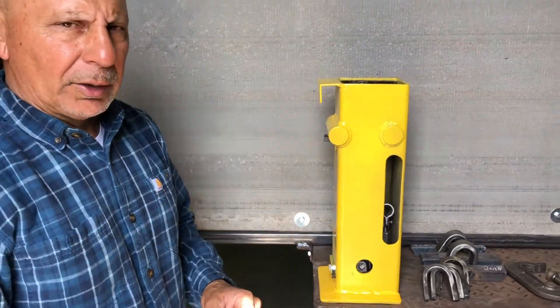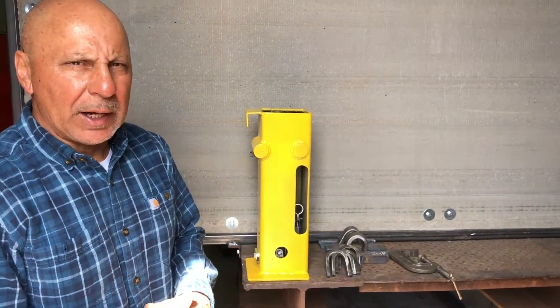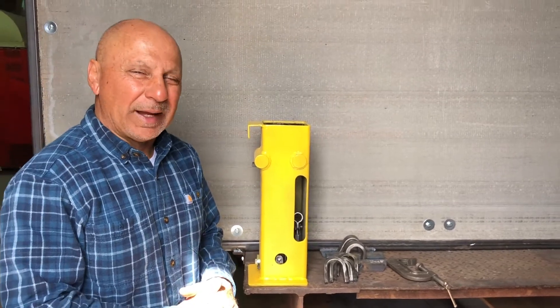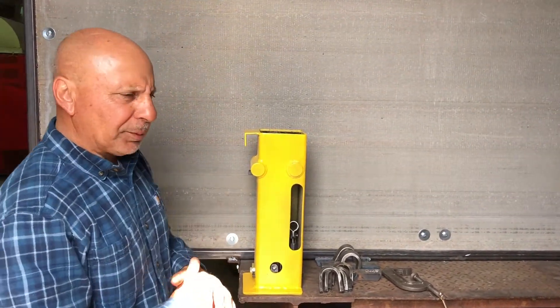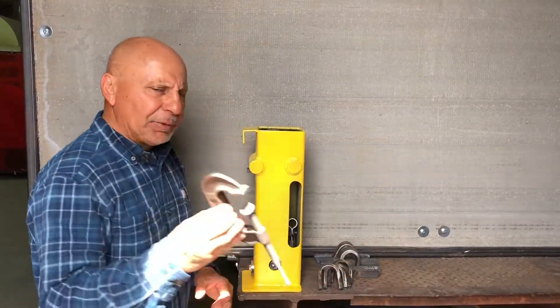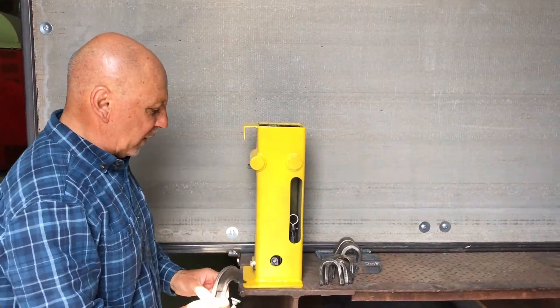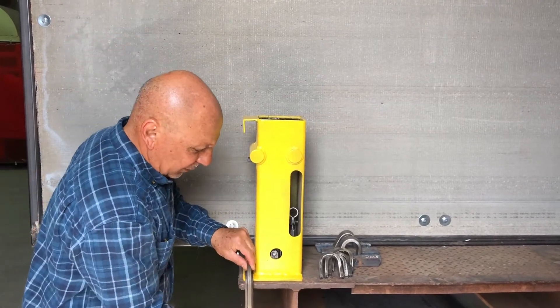The cutout is a little over two inches wide. The code book calls for a minimum two-inch wide cutout, although the most you're ever going to bend is going to be like an inch-and-a-half specimen. Nevertheless, we've cut out approximately two and a quarter inches. Once you've got the specimen in place, be sure you clamp down — this clamp is not included with the parts. The jig should be clamped down to a table like so.